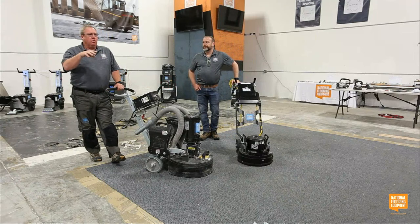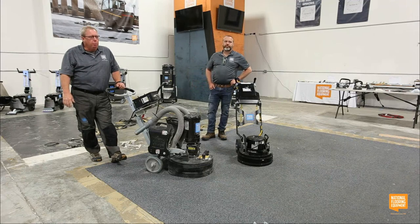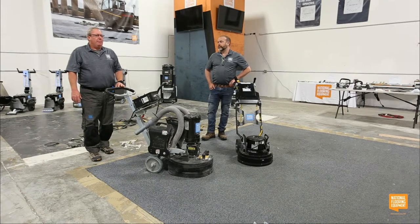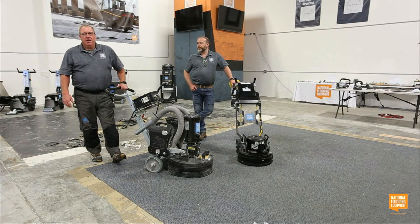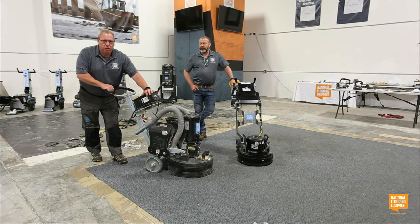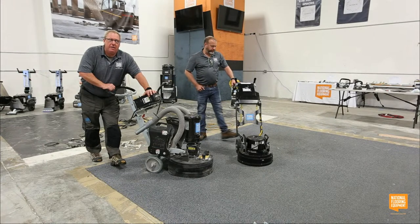We got some guys from California. What about my guys from the East Coast? Super old buildings, super old homes. They all still have 15-amp breakers. So what happens when you plug in a machine that's pulling 18 amps? Anybody guess? Anybody do basic math? Trips the breakers, which is really frustrating. Or this, what about a GFI in the garage? This machine actually has a 15 or 20 amp selector switch. So if I put it on 15, oh, and the Canadians love this because the Canadians only have 15 amp breakers.